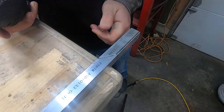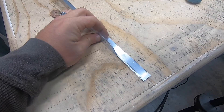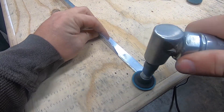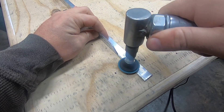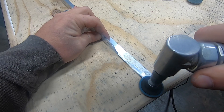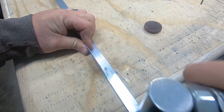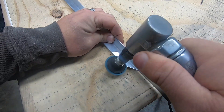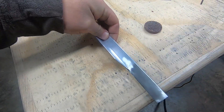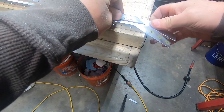I was happy with the overall fit of the original parts, so I duplicated the length and the end profiles. After cleaning it up, I marked a center line so that I could see it through the holes in the skin, confirming things are centered up. I clamped it up and transferred the hole locations through the skin. If I was to build another airframe, I wouldn't fit these parts until I had the tail cone upper and window skins to a point where I could mock things up just like this — it just saves you from guessing.